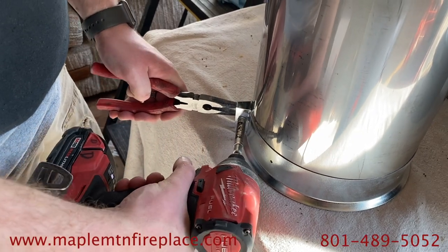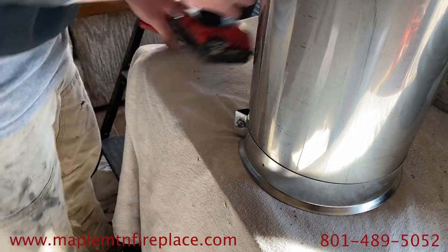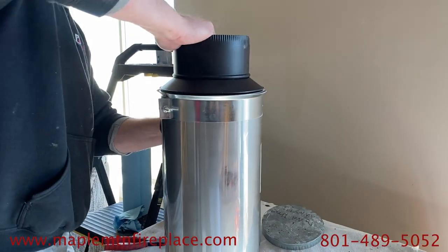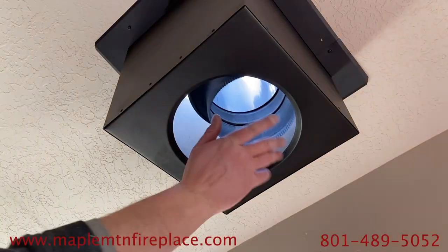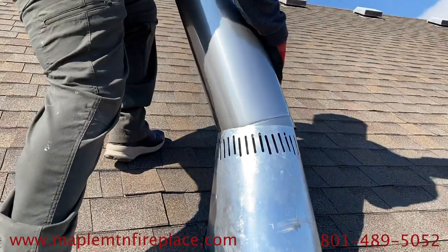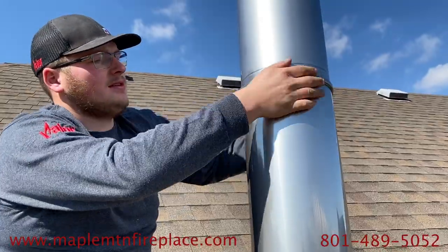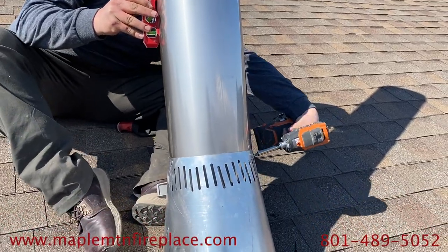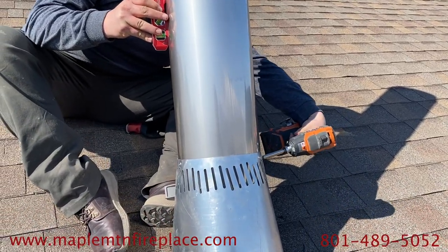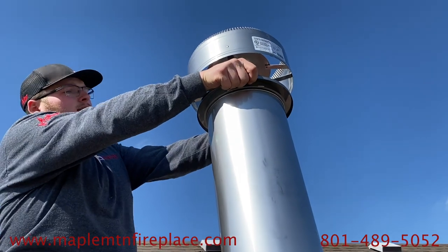So the first section of pipe — we're attaching the bracket that actually supports the pipe, and you can see the black fitting there — that is your stovepipe adapter. For this chimney we used an 18 to start, a four-foot piece, and then a two-foot section on top. They come with locking bands, really easy to install. Make sure the chimney is level and then we add another screw to the top of the flashing. Chimney cap — just twist-lock it nice and tight, no screws required.